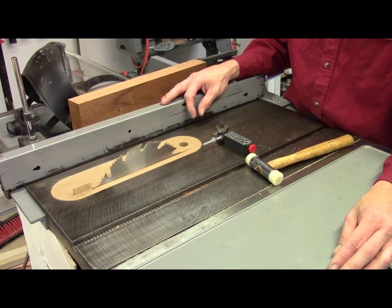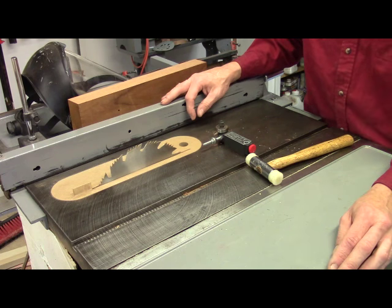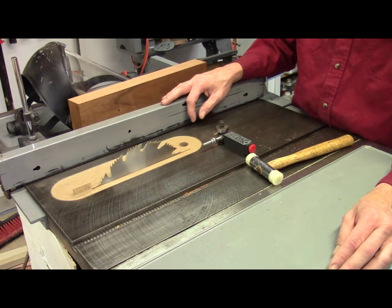The thickness planer needed a little bit of test cutting, and even when you pick straight grain stock — which you should for cock beading — I would get a piece that would shatter. And even if it didn't shatter, there would be snipe on the in-feed and out-feed ends. We're working to pretty tight tolerances with cock beading, so those pieces would have to be thrown away.